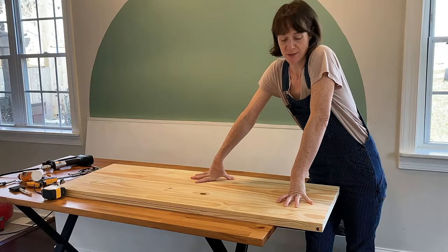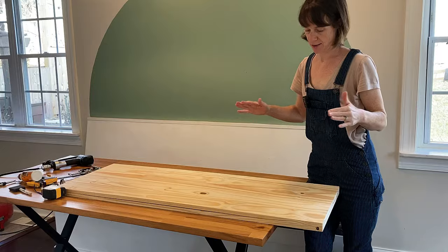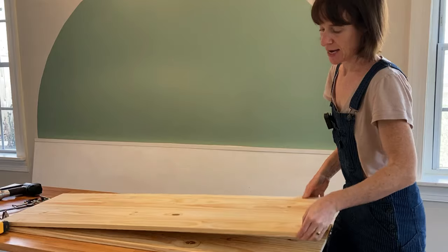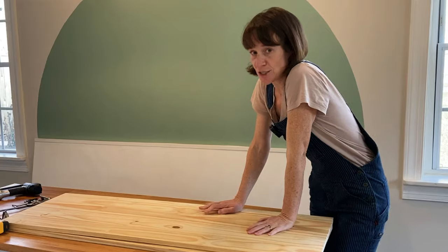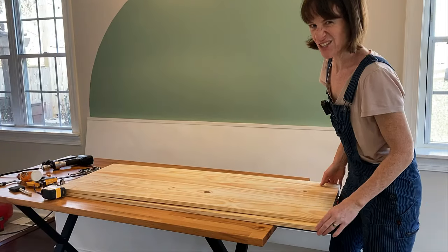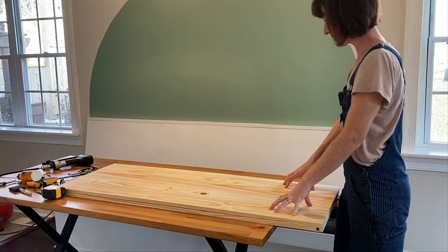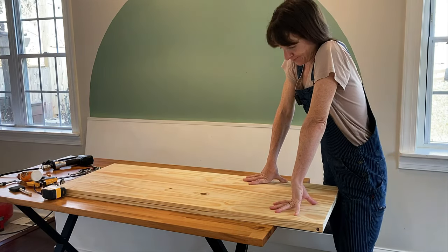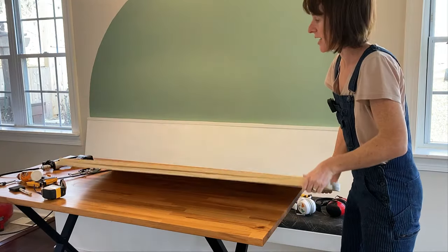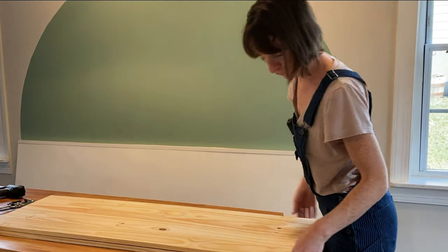I'm ready to make the top surface to sit above my cabinet unit and below the shelving unit. I bought two pine project panels and I'm going to do a glue-up. This project is really stretching my carpentry skills, but I think I can do this. My plan is to put a ton of glue on this, clamp it down, put a few brad nails in the bottom since that's not going to show, and then just wait. Eventually I'm going to cut it down to size, but I'm doing the glue-up first.